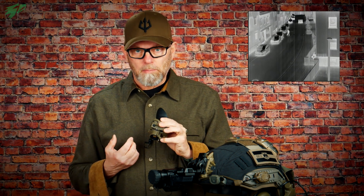This describes the quick and easy commissioning of the Tilo. You push the lens flap about two millimeters to the right to unlock the flap and let it go. It jumps up and folds away to the left. After about three to four seconds the image appears on the rear display. The image is not calibrated yet — meaning not adjusted to the ambient temperature.